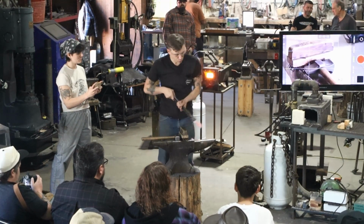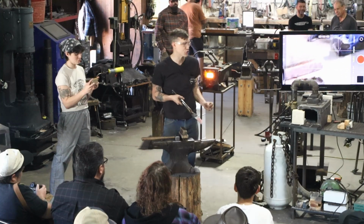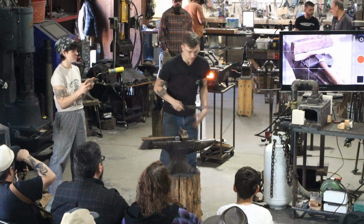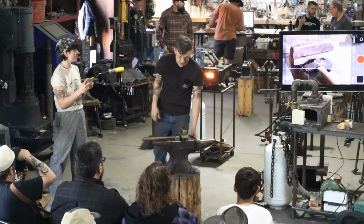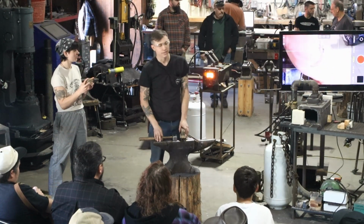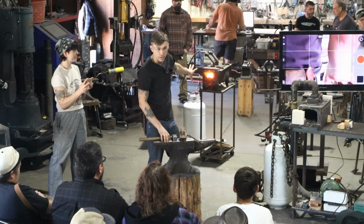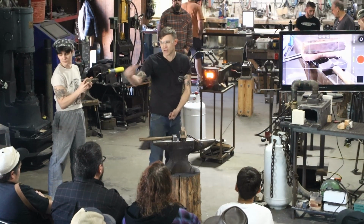So it's very important to forge the thing while it's hot and not try to keep forging once it gets kind of cold. It's just really easy to want to keep working on it, you know? So part of whether it's a knife or really any smithing is striking while the iron's hot. And I find that people that can control themselves and hit it while it's hot and get it right back in, they're going to take shorter heats, but they're going to be done faster.